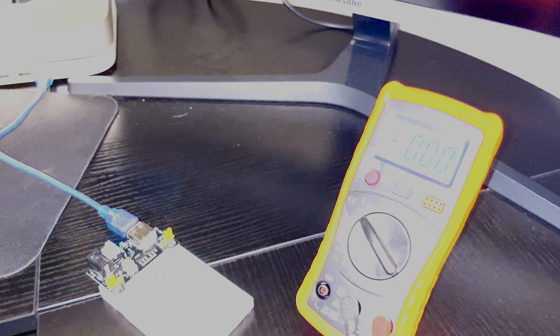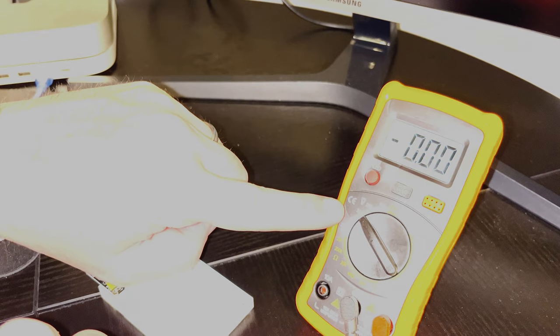Now, as I mentioned earlier, there are larger breadboards that have a banana plug connection for an external power supply. The electronic kits that we'll be using actually have a small power supply that connects to your computer to get voltage for some of your experiments. You can see on the bottom that this power supply connects directly into our breadboard, which applies voltage and ground to the bus strips that we can tap into for future experiments. Let's connect our power supply and we will check the voltage using the DC setting on our multimeter.